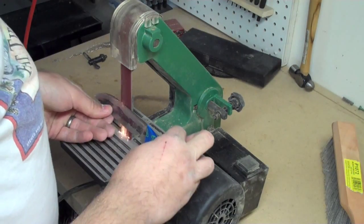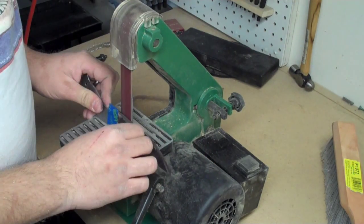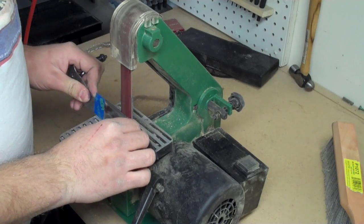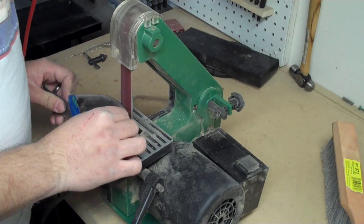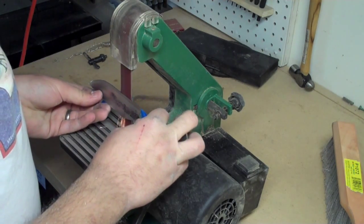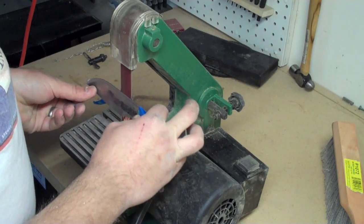I've also added a little bit of tape to the very end of the knife where I want the blade to not be a blade anymore — that's a bit of a dummy prevention for me. At this point, taking every single pass, I'm not removing very much material, but instead focusing on making sure that everything is as even, level, and straight as I can make it — and I didn't use a jig.